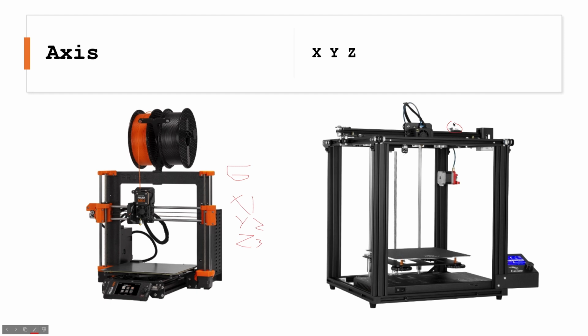It's harder to see on newer printers because they're not really using traditional end stops. Anyway, back to the point. Basically, they just use tension, like the printer can measure the tension of when it's close to it, or light sensors or stuff, but this is your traditional end stop. So what this will do is when you start the print, the x-axis will home, and basically the print head will move. It'll keep moving this way until it hits this. And now the printer will know, okay, x-axis is at 0.